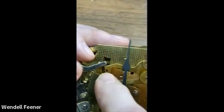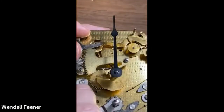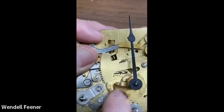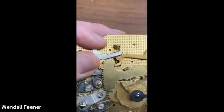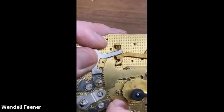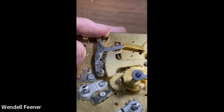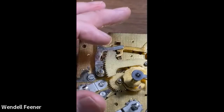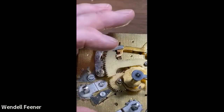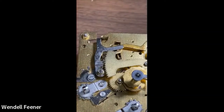Then you put your washer on — it will only fit one way. Slide that on; when you get up to the high numbers the shaft becomes visible, then put your washer on and lock it in place. That's all there is to set up. We've set up the rack to the snail, and we've set up the minute hand so it's doing it at 12 o'clock and not five after.